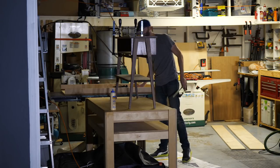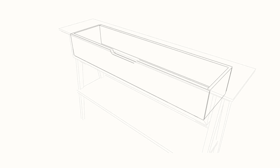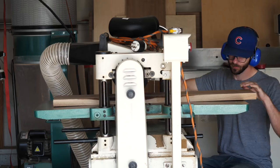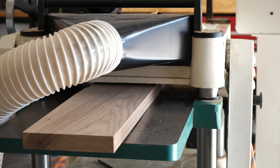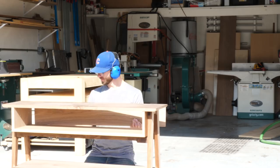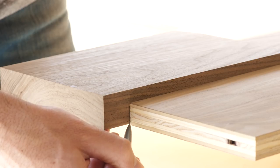The last thing to do was to build the drawer box. I decided to make a different kind of box for this project — just a simple box that slides into the cubby, no rails or hardware. The front and back pieces received a rabbet to accept the side pieces, and the side pieces get a groove for a bottom panel. I'm building the front out of hardwood and using leftover three-quarter-inch plywood for the sides and the back. After cutting out all the pieces and leaving them slightly oversized, I jointed and planed the front piece down to a better thickness of about an inch. Then I nibbled away at the front piece to get it to the exact width needed, and used that setting on my table saw to cut the sides and back piece as well. Then I did the same thing to the back piece to get the exact length, and transferred that over to the front piece so everything was exactly the right size.